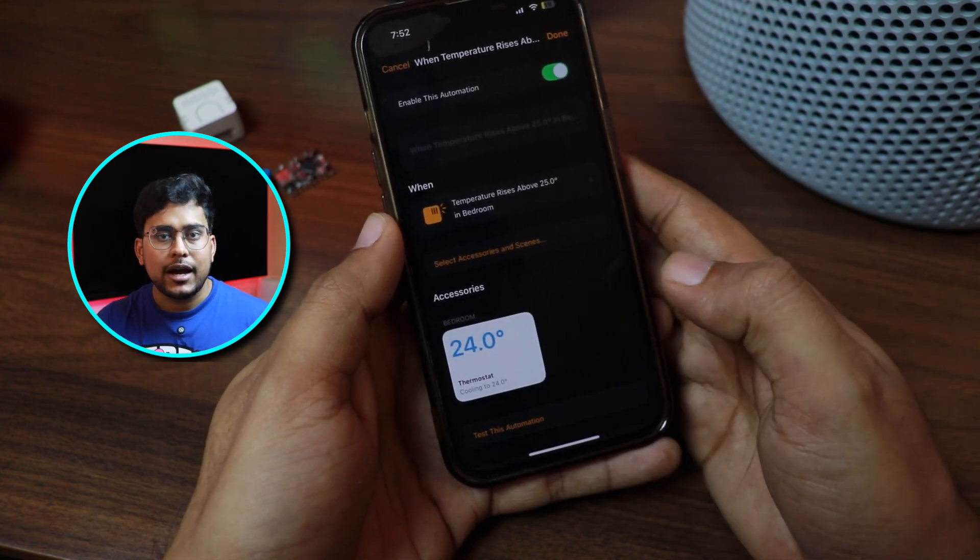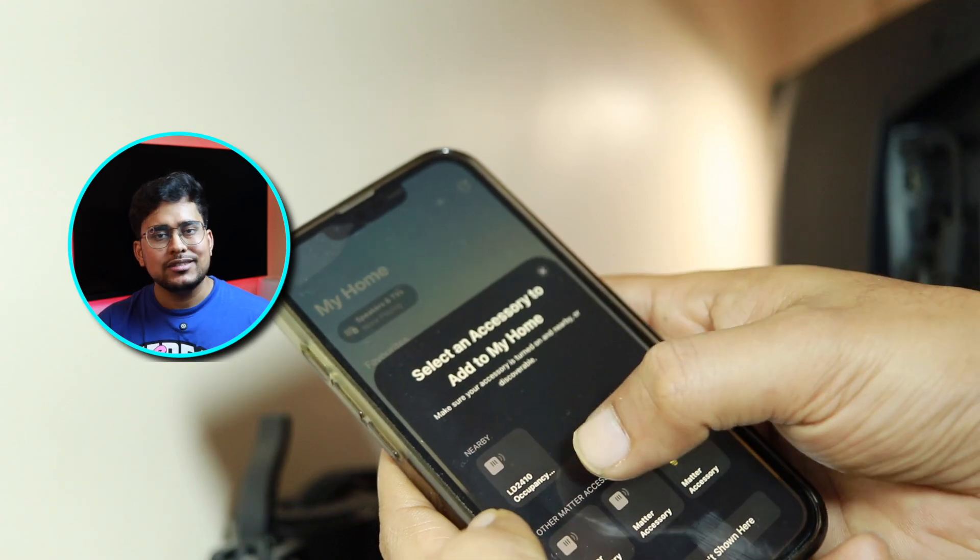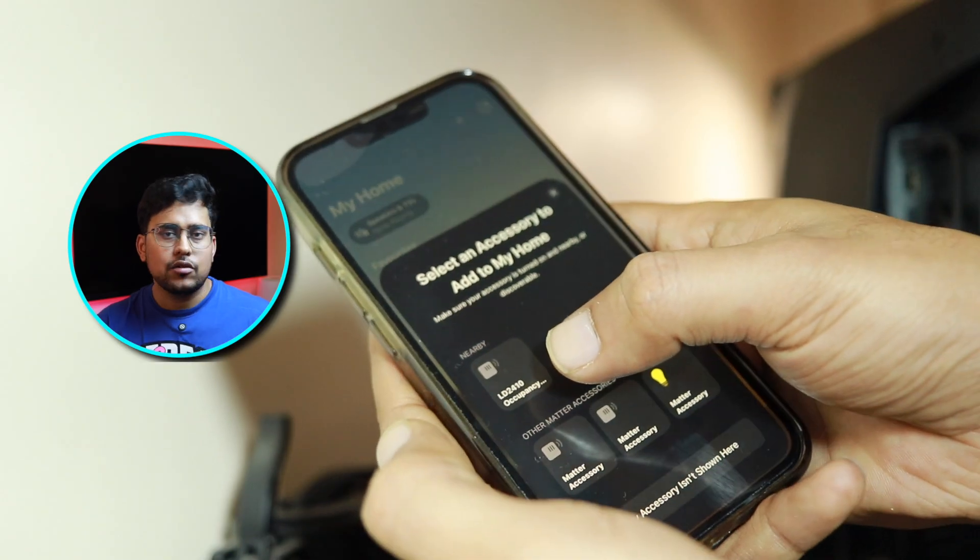You can program it to go into deep sleep for 10 minutes, and after that it sends all the data from all sensors to your hub, which forwards it to HomeKit. You can view it on your phone, create automations, and ask Siri about things like air quality or temperature in your bedroom. You can also use a sensor like the LD2410C to create an occupancy sensor — that may last a few weeks to months rather than a full year, depending on usage.